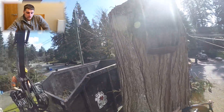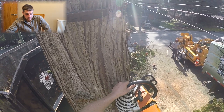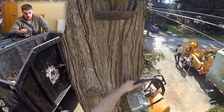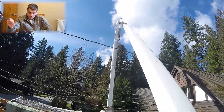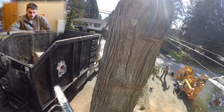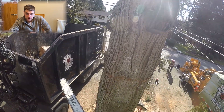Something I've learned more in recent years is that if you're doing a crane pick or something like that, just come all the way through — 90% or so, 95% — and then instead of coming in flat with the back cut, come at a slight angle, like you're putting a notch cut in the top. It's normally a better way than trying to do a step cut.